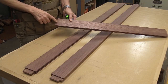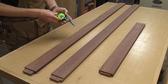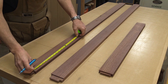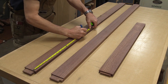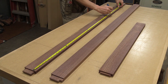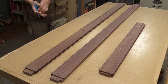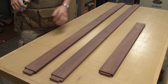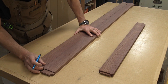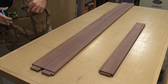After marking the center line on these stiles and knowing the rails are 63 inches long, it's easy to divide by 3 — that's 21 and 42. I'll put the two rails together, even up the ends, and strike a line across both of them at once.